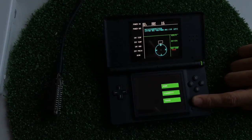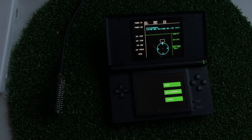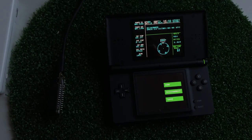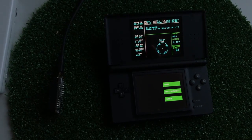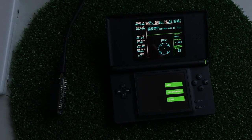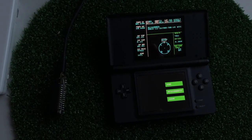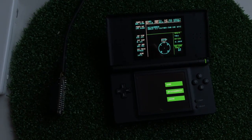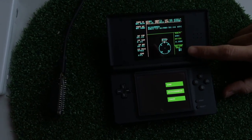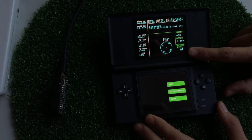So let's connect by pressing Start here — or we could also press 'Connect' on the screen. You can hear that a sound is played whenever it connects to the Wi-Fi. It changes into the disarmed state, and data as it comes in is displayed on the main screen. Whenever the battery voltage goes below 3.4 volts, the Nintendo DS plays a warning sound. You can see these numbers here represent the incoming packets and the outgoing packets — outgoing is currently still zero.